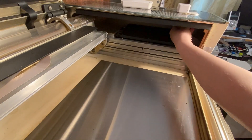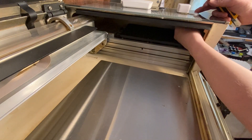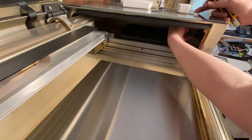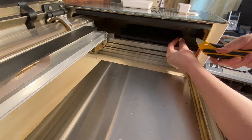On the right-hand side of the Glowforge, you will feel underneath where the on-off button is. There's a wire connector that you can either remove it beforehand, if you can feel it with your thumbnail, and pull the wire down, but be gentle on the wires. It has a little white keyed connector that I'll show you a close-up of in a minute.